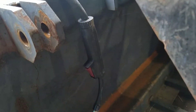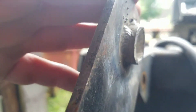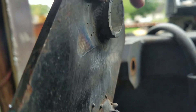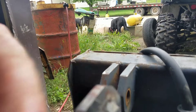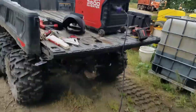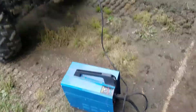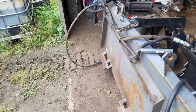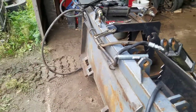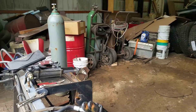I am actually very pleased with how these welds turned out. I ain't done welding it — I called it quits last night. That bead laid pretty nice in there. Hopefully it was hot enough; I think so. If you've got a 3500 watt Predator, you can run their smaller 90 amp flux core welder. I'm going to leave it in my camper with a couple spools, so on trips — side by side — if I break something, I can fix it. At least that's the plan.